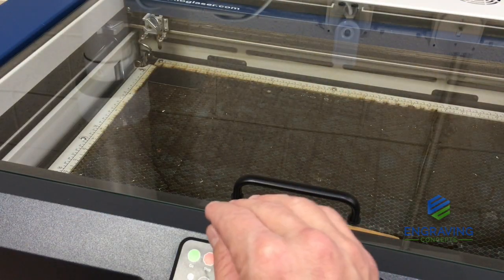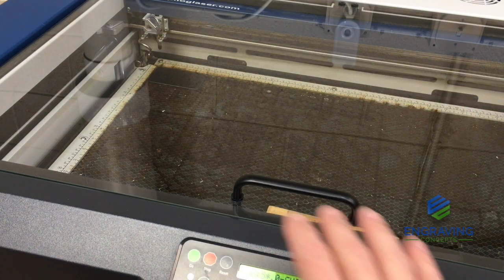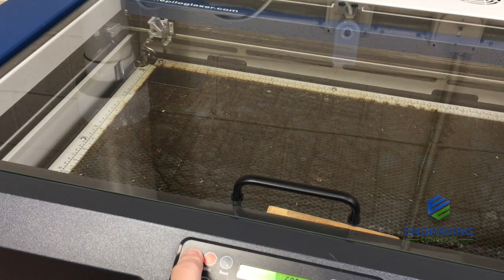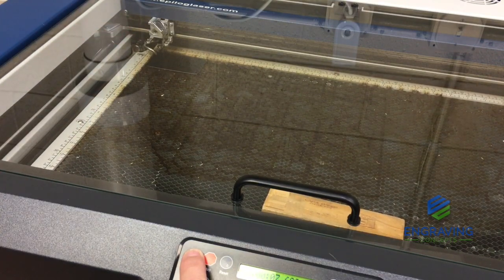Make sure that your plate and all rulers are in the right place — folded down with the rulers — and the job is where you need it to be with the material inside the machine. When you push go, that will autofocus. The autofocus uses a small plunger assembly located right behind the lens assembly.